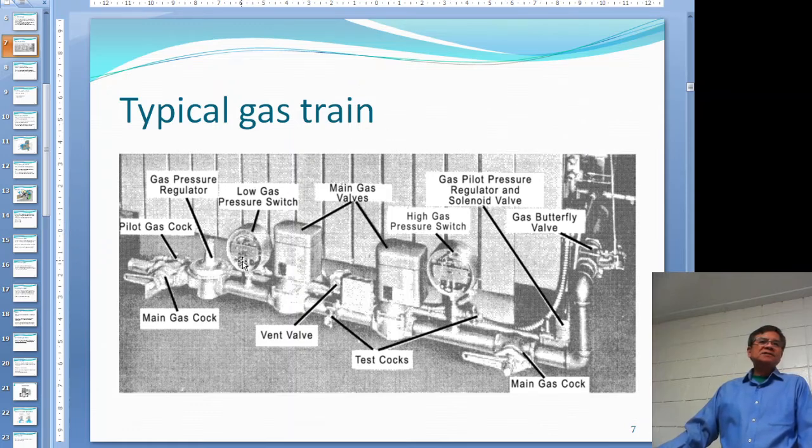Why do we need the low gas pressure cutoff? If the gas company loses pressure — not enough to supply all customers — they'll shut off gas to industrial users first. In that case, if you lose gas pressure and don't shut off the boiler, the automatic gas valves will still be open. When gas pressure comes back on, natural gas will fill up your furnace, and if there is a hot spot, you could get ignition — lots of gas with no air — and you have an explosion. So if you lose gas pressure, you should shut the boiler off and both automatic valves should close.